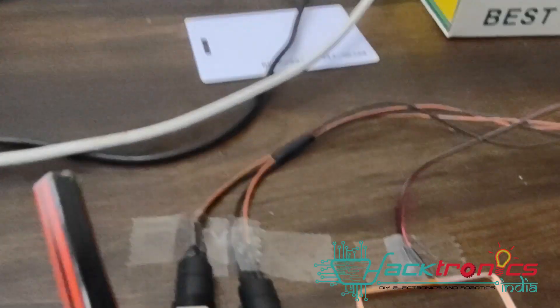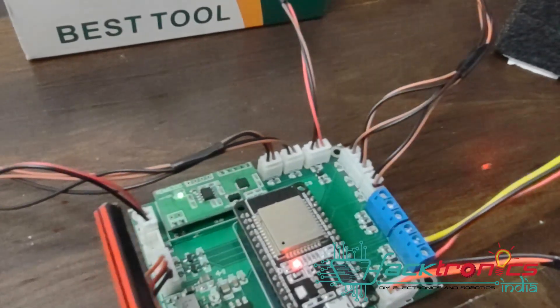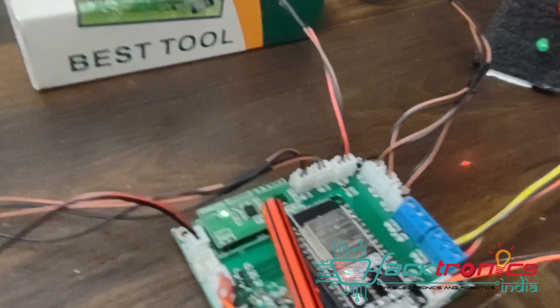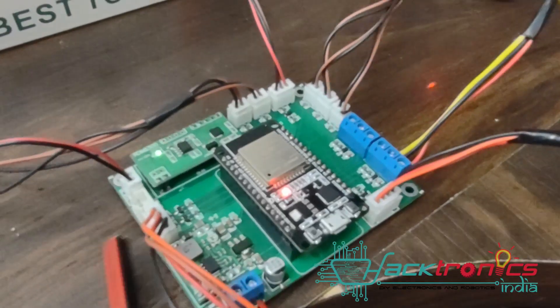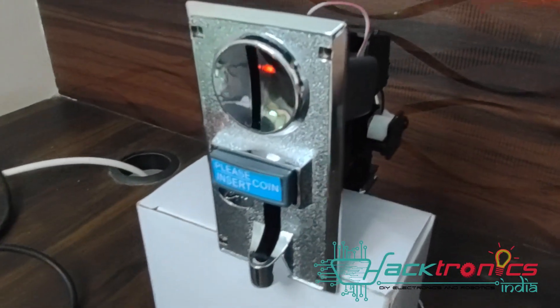You can go into the dashboard and refund the amount if you wish. There are two buttons, an RFID module, the coin slot machine, three status LEDs, and connections for two motors. There is also an RFID coil. The RFID LED slot is not connected here as it needs a different module — that is optional anyway. There is an I2C interface, so you can connect any kind of sensor. For this demo I've connected an I2C LCD.